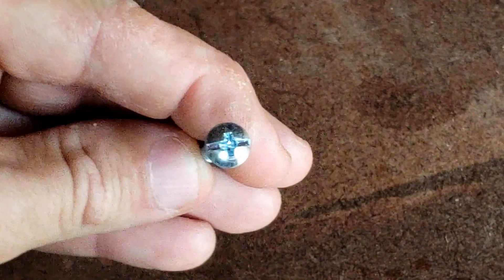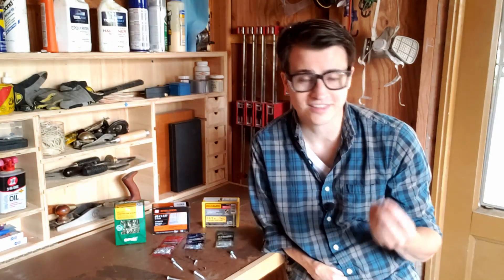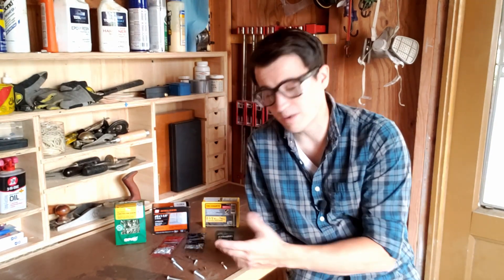There's also a combo type of head which is both a Phillips and a flathead. My problem with Phillips is that they do strip out very easily, so I try not to use a lot of Phillips. My favorite type are the star or Torx drive — I think the newest type out there. They have a six-sided star on them. I've never seen one of those strip out. They're always the type of drive you see on the premium screws, and when you buy these the box will usually include a driver bit that fits the screw heads. So free driver bit.